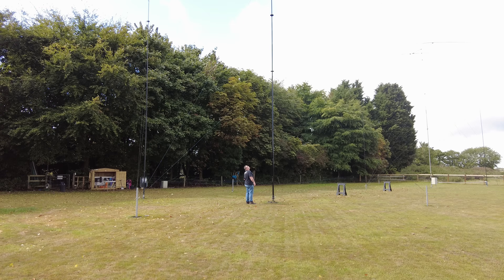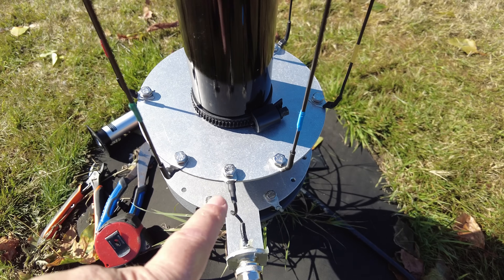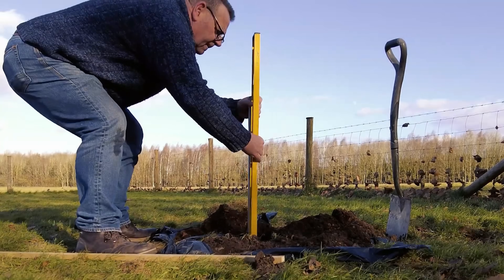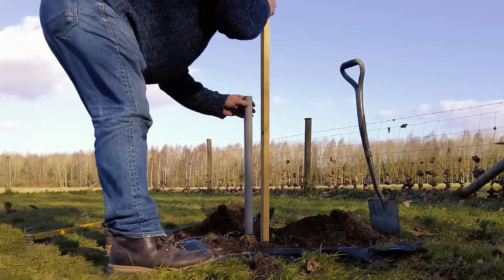Let's be clear about what a DX Commander actually is. It's a fiberglass pole with normally about six quarter-wave wires going up it in a circle. Each wire has a fork connector on the bottom, a loop and some shock cord on the other end, and maybe halfway up a little tensioning loop. There's an aluminum spreader plate where the driven elements connect, and it's all marine-grade and UV-stable plastics — everything chosen for cold, heat, sunlight, and wind. For the Signature 9 you'll need a hole and a bag of cheap concrete from the DIY store.